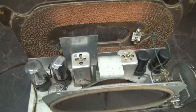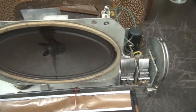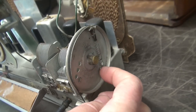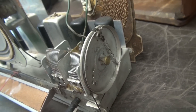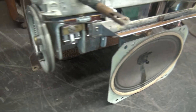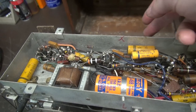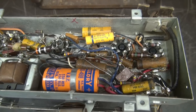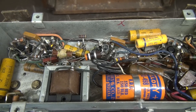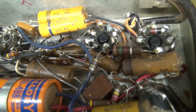So let's give her a quick look over. You can see she's pretty clean. This is your built-in AM antenna. Here's your tuning. It looks to me like somebody has replaced this dial cord in the past, especially with this super stretched-out spring — it's like they got a little short, but it's working fine. Let's take a look at the underside. I'm doing a little balancing act between the speaker and the antenna. You can see she is full of all the original caps. I really don't see any signs of any maintenance in the past, and a lot of these are ooey gooey rich and chewy, so they all got to come out.